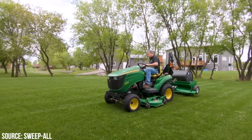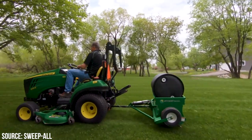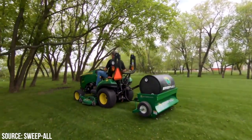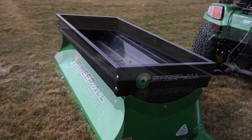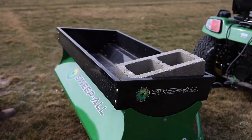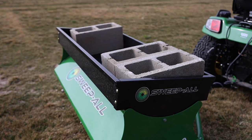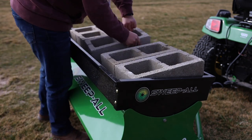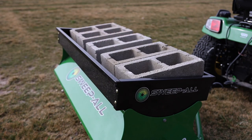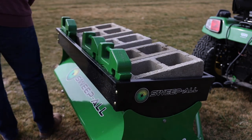If you don't get the weight box, I guess you can stick a barrel on top and fill it with water. If you fill it all the way to the top you're fine, but if you didn't it might slosh around and cause some weird weight distribution. Either way, I did get the weight box and I put five cinder blocks and four suitcase weights on top. They didn't fit all that nicely honestly, but it does work. In the future I might opt for sand or gravel or something like that. Overall the aerator is 275 pounds, and with the extra weight I put on I think I'm just a little over 600 pounds.